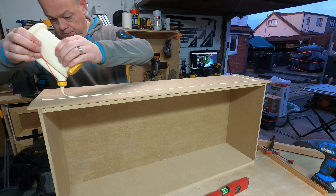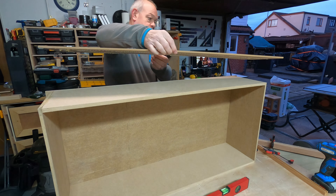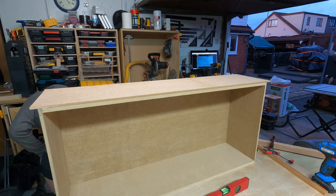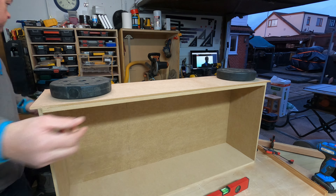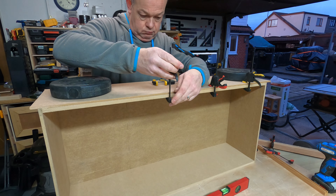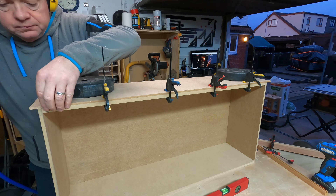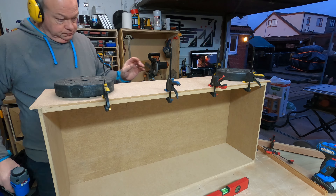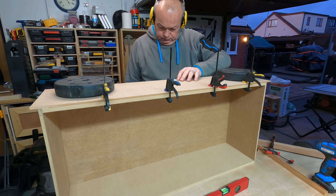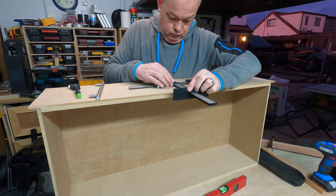The last stage was gluing the face frame on. This was really straightforward because I'd already got it levelled and knew exactly where it needed to go. I glued it on, clamped it down, and put a couple of weights on to help it all go together. I considered whether to put in a couple of brad nails — I chose to put them in because eventually I'm going to put an edging strip around it which will cover up the pierce marks. I could have filled them in, but I only put a few in and some of them almost look like the fleck of the wood.